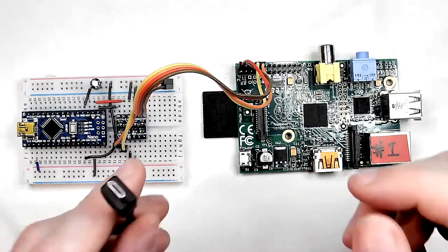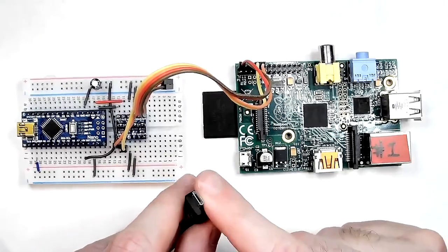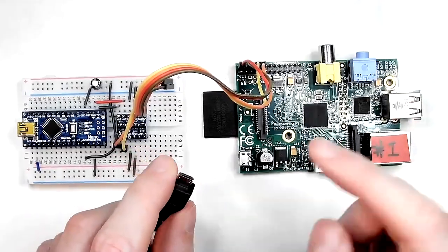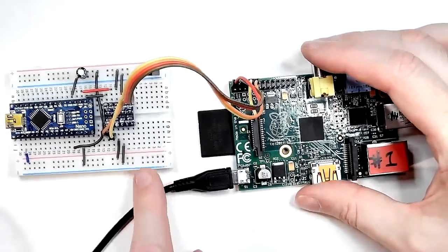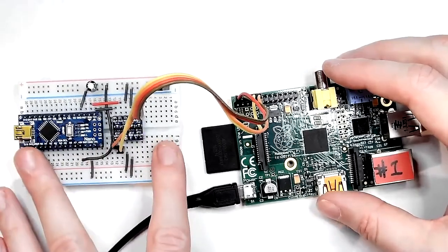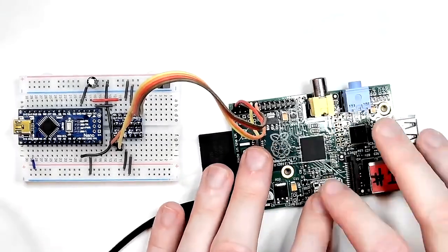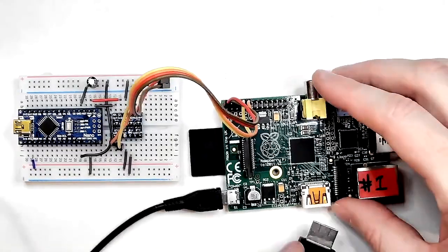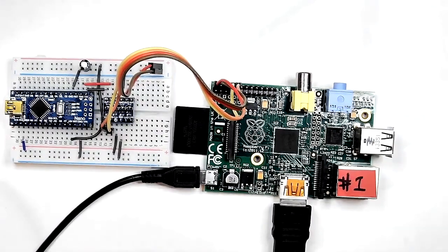To power this I'm going to use a Raspberry Pi 2 power supply — you can use a Pi 3 supply too, but not the Pi 4's USB-C supply. We want a micro USB connector, 5 volts 2 amps. Plug that in and connect to the mains. This one power supply will power both the Pi and the whole Tiny Basic Arduino setup. We can then take full advantage of HDMI: clip the full-size HDMI cable straight in for a clean signal to a modern monitor.